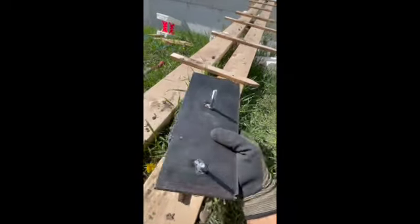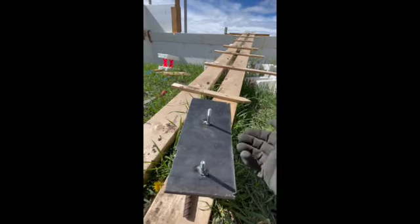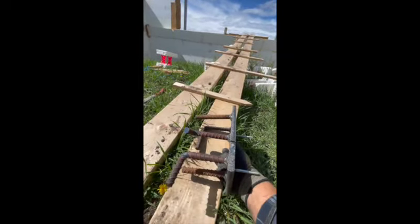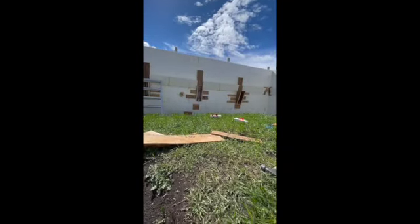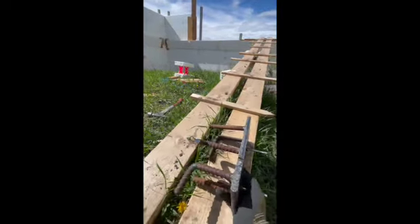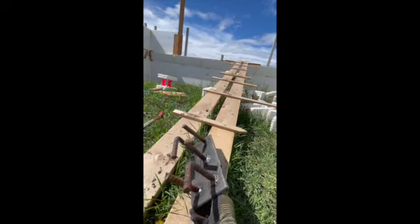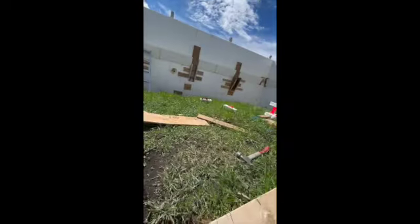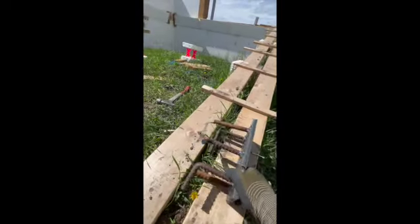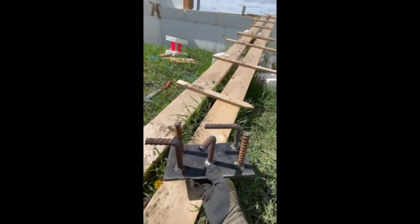And then I attached these temporary 1/4 inch bolts, and they're only to hold onto the wood until the concrete is bonded to the rebar. And then once I take the forms off, I will cut these little 1/4 inch things off with my angle grinder. But all I did is I cut these out on the plasma cutter on just some scrap 3/8 that I had, and then I had a bunch of 5/8 bar kicking around from putting in the walls. So I think they're quite ugly, but boy, I think they're gonna be strong.